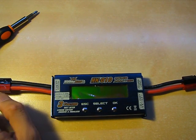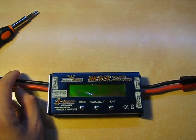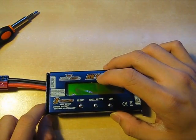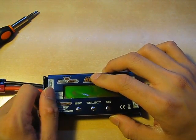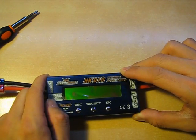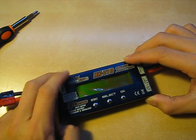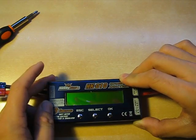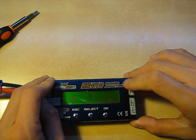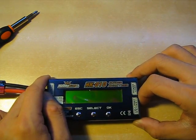It's good enough for maybe 80 to 100 amps for short loads, but overall it gets a little dicey — I wouldn't want anything melting, shorting out, and sparking. In terms of the user interface, it's all good except for that really annoying beeping sound that makes me want to desolder that buzzer. There are a couple of cheap-outs in design, but it's $19 — I can't argue with that. For the price and product you're getting, it's insanely hard to argue against. Everything seems done right except for some UI issues and the current sense nitpick, which won't affect 90% of the target market.